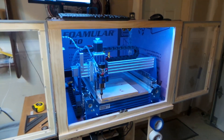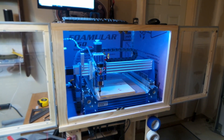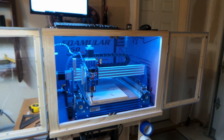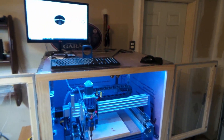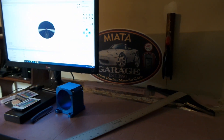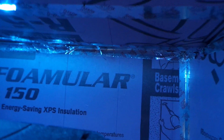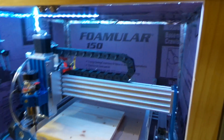I was testing this out last night and I discovered by accident that I created like a negative pressure box, because this is sealed up pretty tight. You'll see it — if I turn the shop vac on with the doors closed, it seals everything pretty tight and it sucks in a little bit of the top back here. There's a seam of tape where I had to piece it together because my pieces weren't big enough, so it'll suck down this middle part a little bit. I had to reinforce it with a little aluminum L-beam — like a three-quarter by three-quarter piece of aluminum — to support that seam.